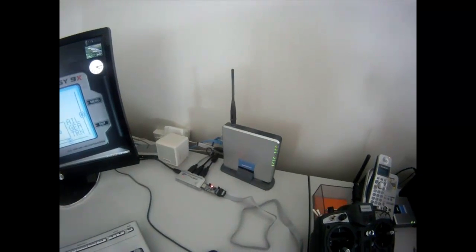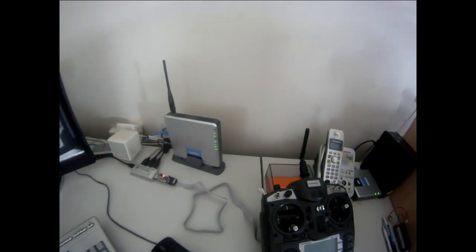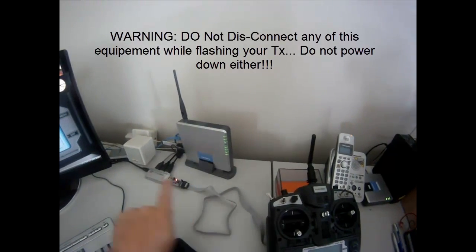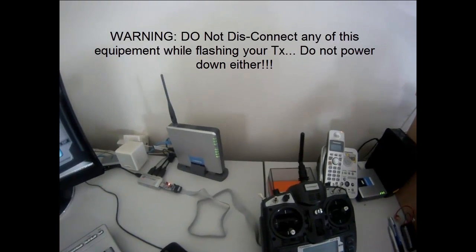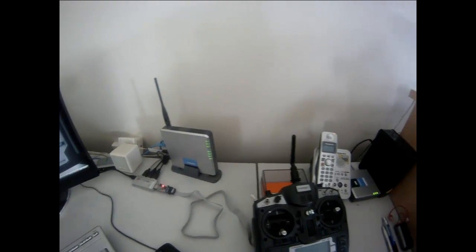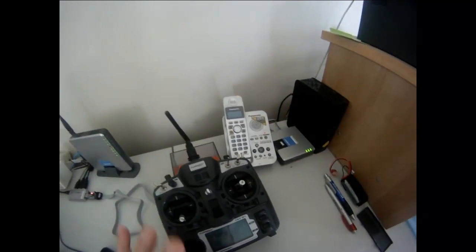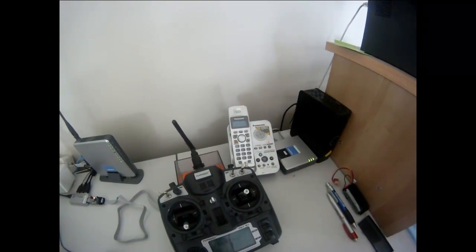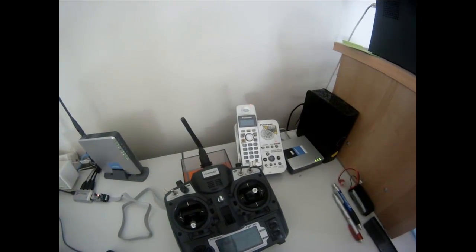If you notice on the board here, there's a red light on which shows that it's powered — which is fine. Just a reminder: do not connect any of the stuff or power down your machine while it's flashing, writing, or reading, because you can corrupt the processor inside the unit, and if you do that you might as well strip it for parts because it's very difficult if not impossible to recover from that.